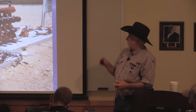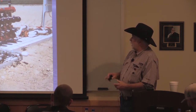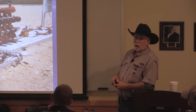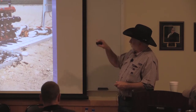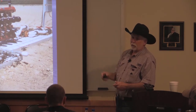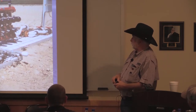And again, here's one I actually put in when I was with Netafim back in '97. This was a corn research block at Garden City, Kansas, and that's actually the primary lagoon from a feedlot at Garden City. And we're using feedlot waste through disc filters and through drip tape. And the drip tape today is better than it was in '97. We've made significant improvements in the dripper.